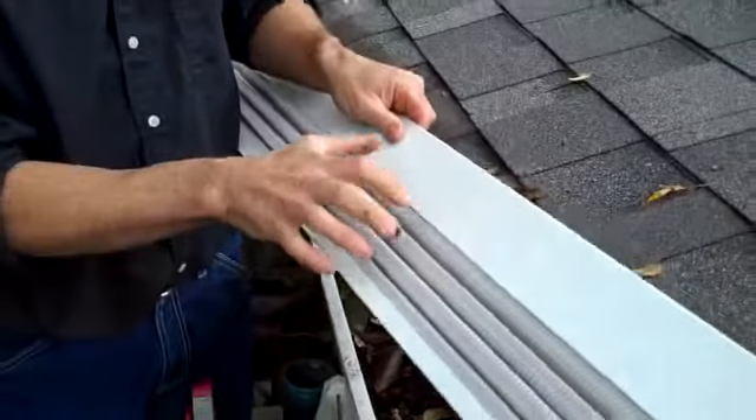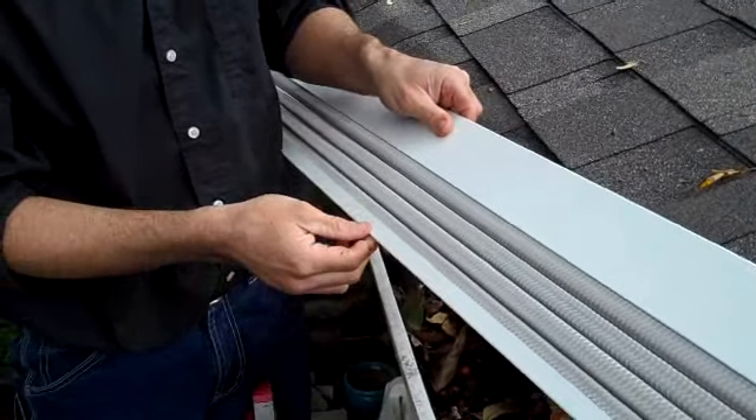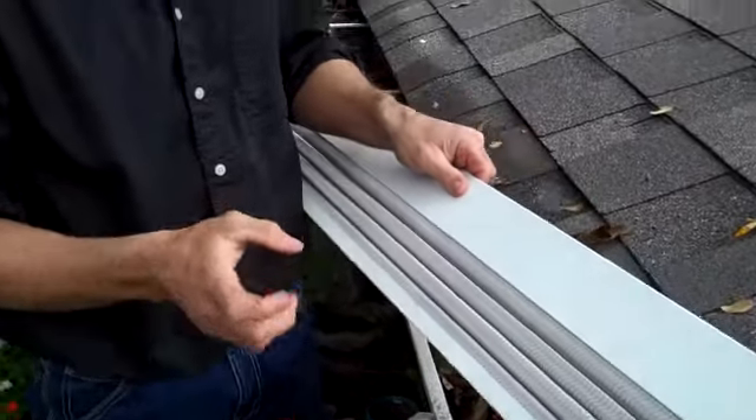Basically, this product will keep all the shingle grits and fine debris out of your eavestrough. This is really good when you have pine needles, because pine needles are probably one of the most challenging byproducts of a tree to deal with. Most leaf guards will let some pine needles in, and because they're so long, sometimes when they get into the downpipe, they don't tip and go out the downspout.